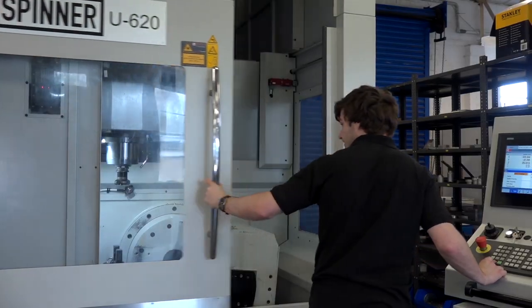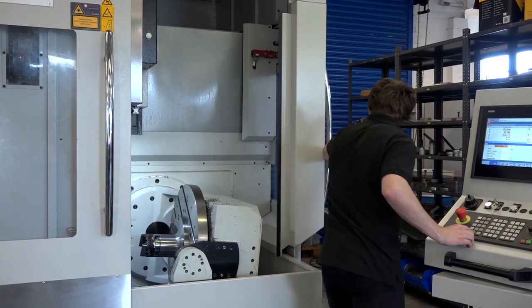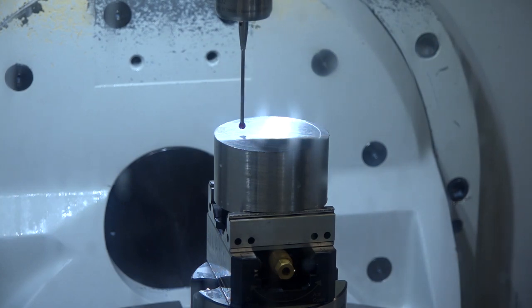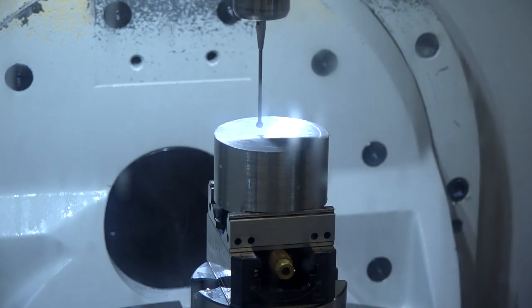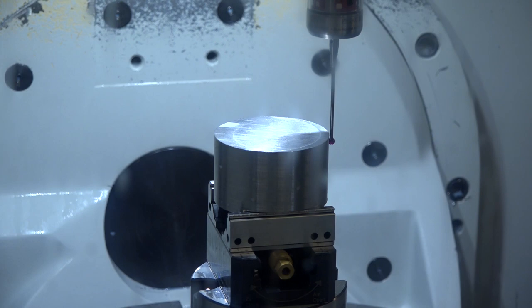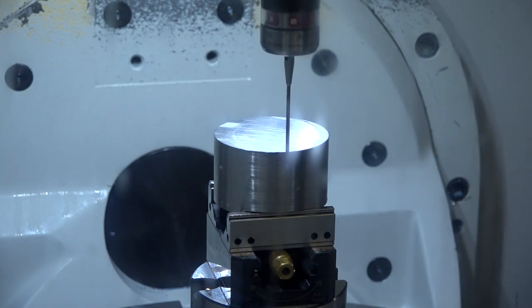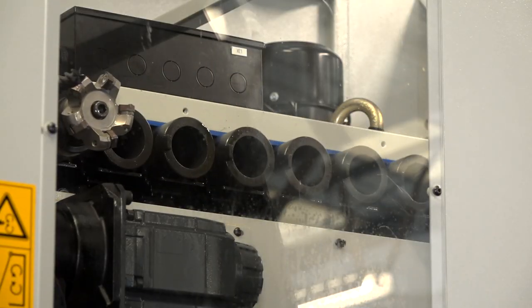The options that you have with the machine — as standard you've got the double door, that makes it nice and easy to get in and set. It gives you a lot of access, especially if you're putting a big four-jaw chuck up as we do — it's very handy to have that access. And the probing? Probing is fantastic, it's so easy. Put a tool in, give it a length, push a button and it sets it all for you. And the tool changer — how many tools do you get with it? We've got 36 on this one. If I was to buy another one I'd probably go a bit higher, but it's plenty for the work we're doing at the moment.